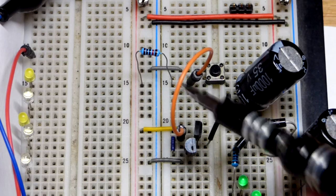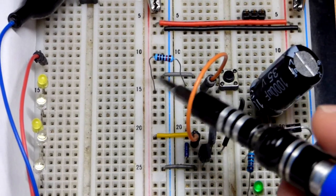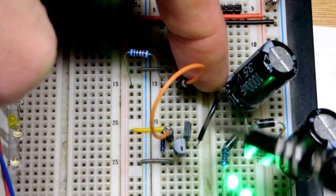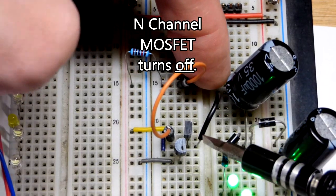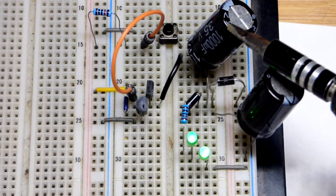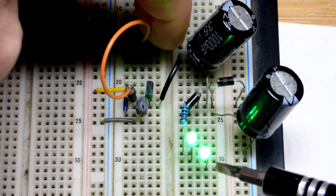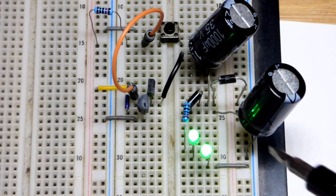We can't go directly to the positive supply as far as the switch is concerned. We have a switch that is connected to the negative supply when I close it. As long as I close it, we turn on the P-channel enhancement mode MOSFET, and the N-channel turns on too — we get a direct connection to the negative supply. So this capacitor is going to discharge at some point and voltage will go down. But each time I press it, we'll see a pulse of more current going through the load.